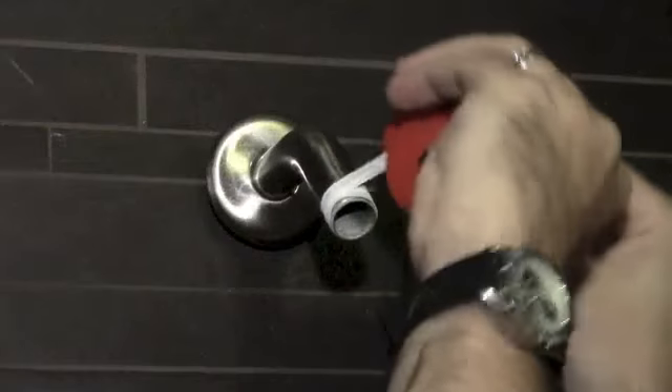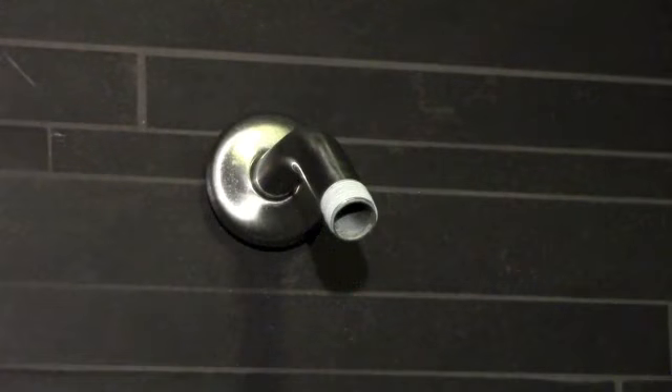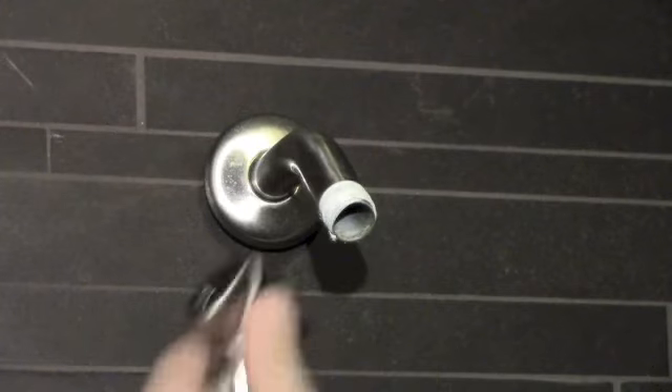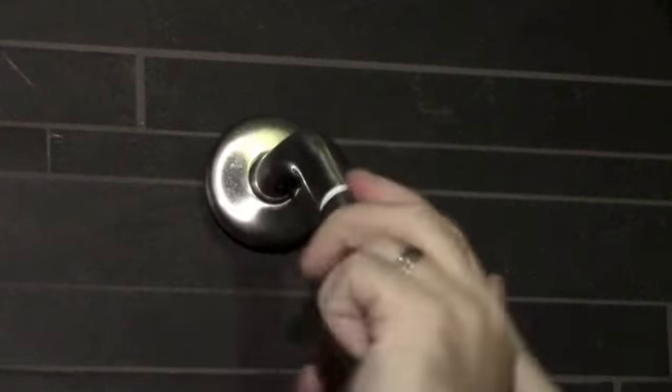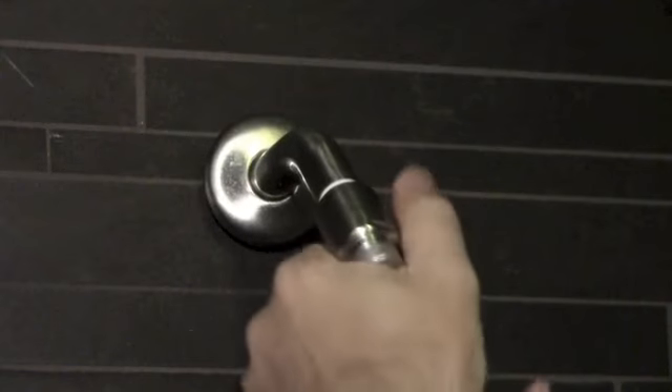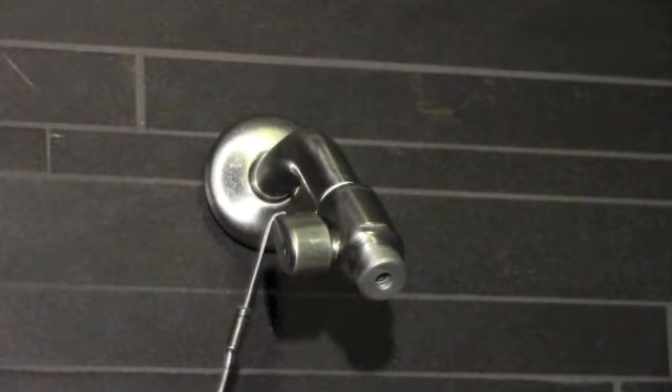This comes with your product, so just wrap your plumber's tape around in a clockwise direction. This will create the seal between the valve and the shower pipe so that you don't have any leaks. Simply take the adapter and screw it onto the end of that pipe. You can tighten this with your hand because you have enough leverage. Leave the cord hanging so it faces the outside of the shower.